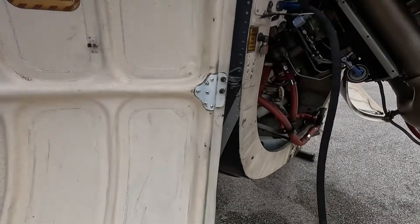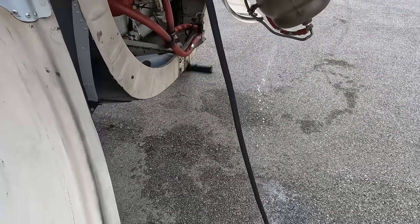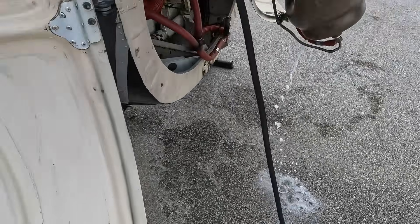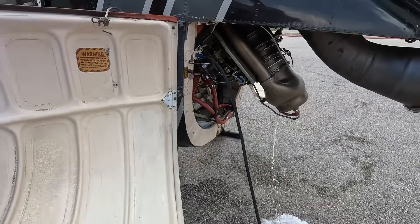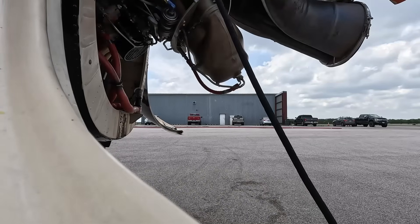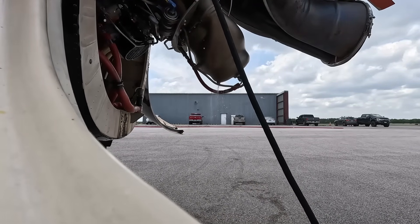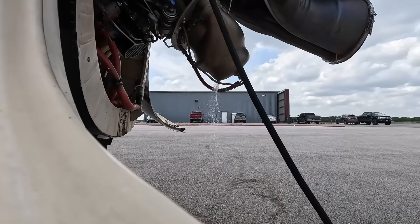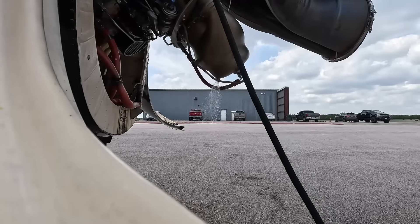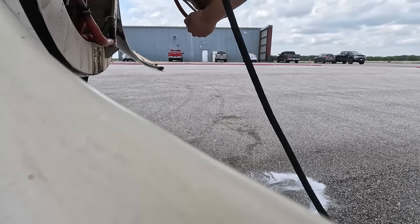Here I'm sending in the water now. You'll see the soap coming out of that combustion drain right there. We just do this a few times and make sure we get all that white suds out. You can see that most of that soapy solution is leaving. Just to double check, we put our hands over there — if there's still soap it'll appear white, but if it becomes clear then that's how we know we washed everything thoroughly.